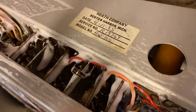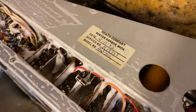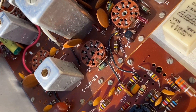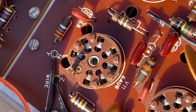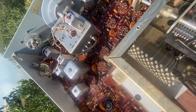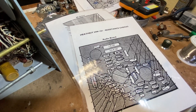I'm going to be careful not to damage this sticker because it's part of the rig's history — it's a historical artifact. Then in the oven at 170 degrees for 20 minutes, and then I turn off the oven and let it sit in there for another 20. It's the next day, and here it is. Look at those boards — gleaming. I let it spend about 10 hours on my back porch after the oven drying. So I'd say it's ready for the next step. Next step is to check every resistor. I made up these handy cheat sheets from the manual, and I laminated them because I do so many of these.